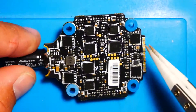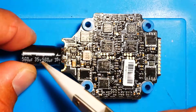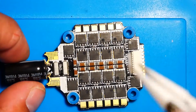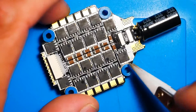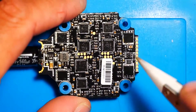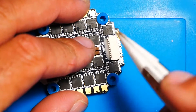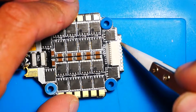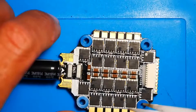You can see conformal coating on the bottom. Flipping it over, it's not really square — it's got more of an octagon shape. This is a 35 volt 560 microfarad capacitor; it wouldn't hurt to add another one. The FETs are way bigger, you've got a nice row of capacitors, and there's your shunt resistor. One big upgrade is the connectors — quite a few guys probably ripped these off before. It is soft mounted, which is very good.